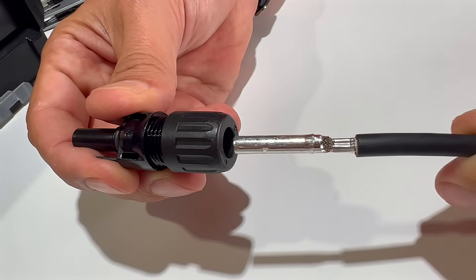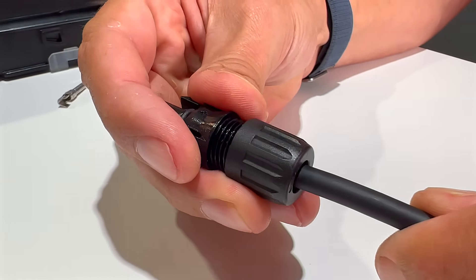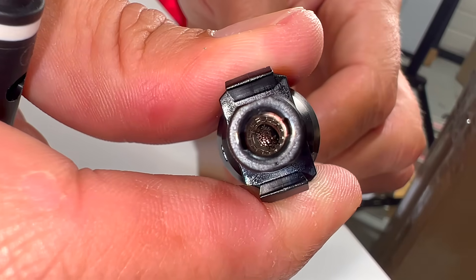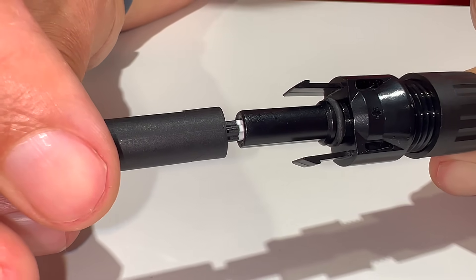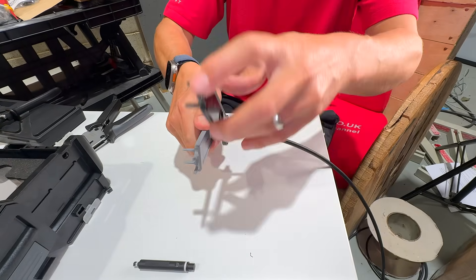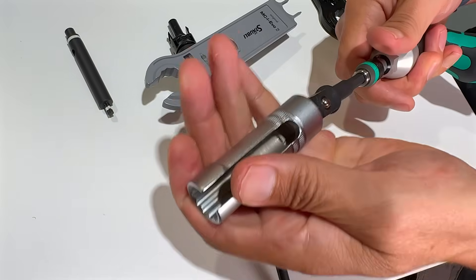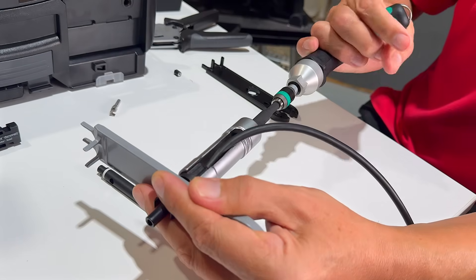After crimping, lift the backstop bar to remove the crimp. You should observe that the crimp connector securely captures all strands. Insert the crimp into the plastic housing — you don't need to remove the back nut. As the crimp connector enters the housing, you should hear it click into place. At this stage the crimp cannot be removed from the housing. You can check the correct placement within the connector using a test pin; when correctly positioned, the white line will still be visible. To complete the assembly, the back nut needs to be tightened around the cable. This adds additional strain relief and prevents moisture entering the connector. Tighten the nut using the MC4 spanners and complete the process using a torque tool set to 3.4 newton meters.